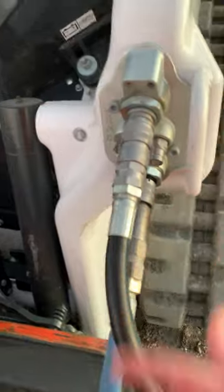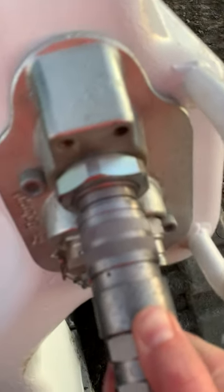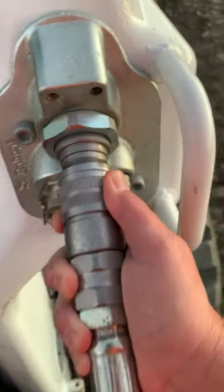These lines are under a lot of pressure. So the key is to bleed those valves. With these, it's fairly simple — you just got to hold them in. It just goes in just a very little bit. If you do that for about five seconds, it will basically bleed that valve, and it'll make it a lot easier to disconnect.